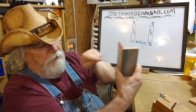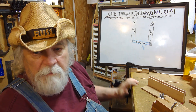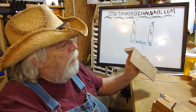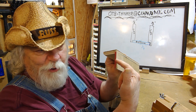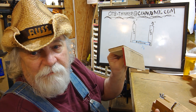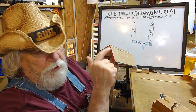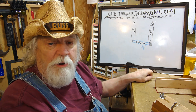When you're done, the only place you'll see the pin is on the bottom of the box, because that's where the pins are drilled — so they're completely hidden. Putting bamboo skewers in through the bottom to hold the pieces together is quick and easy and gives you a lot of strength. Now for that bottom to pull out would be very difficult with those bamboo skewers supporting it. You just have to make sure you go in through the bottom board. You can technically go either direction — set it to a quarter-inch to go into the rabbet ledge, or half-inch to go into the side board.